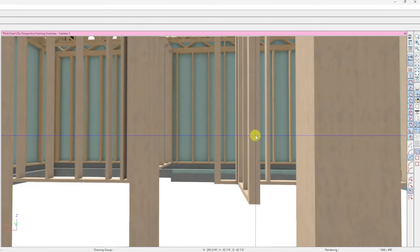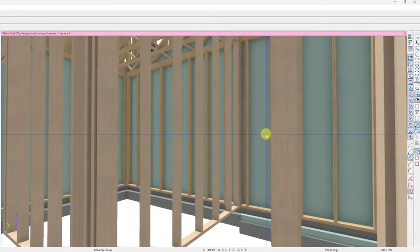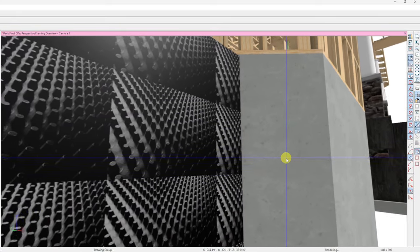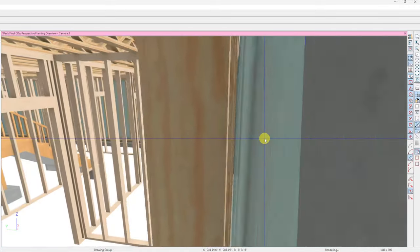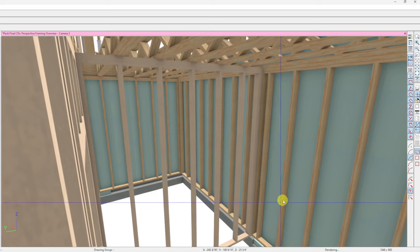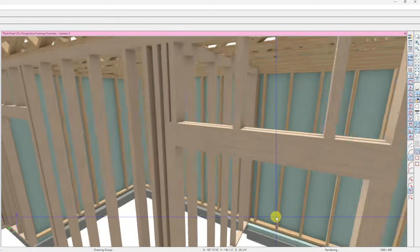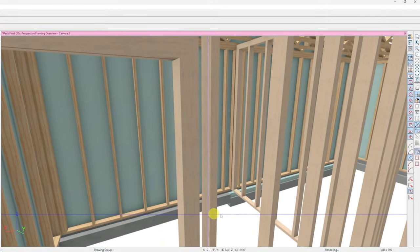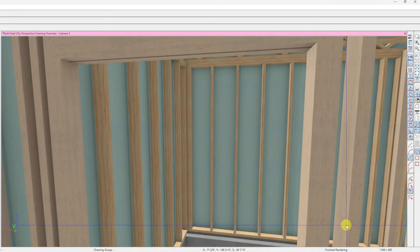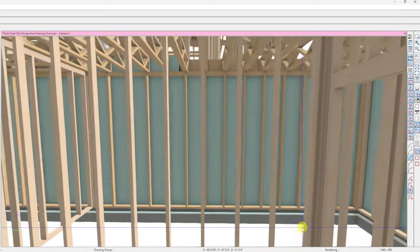This will be facing west, and that is the south wall. I'm going to talk to Tucker in about 20 minutes — he's backing up a semi. We're going to probably change this wall to Nadura, which is ICF block — foam two sides — and then this will extend through. There will be a little jog here and we'll probably want to frame that through to this wall to keep that weird space out, unless Josh wants it to hide stuff. Over here we'll drop back 45, a couple feet — that may be the only real change in play.